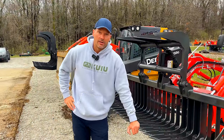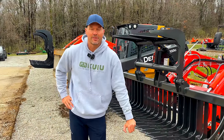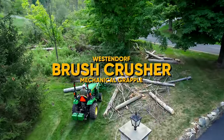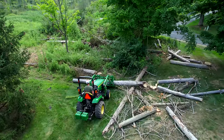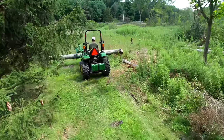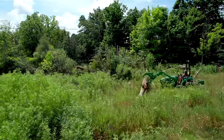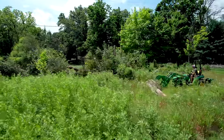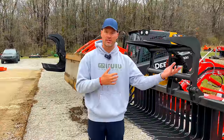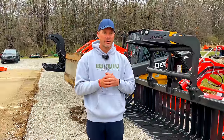If you don't want to mess with electric and you have a quick attach — John Deere quick attach, SSQA — you can get a brush crusher. I used to be really big on brush crushers, but prices have gone up quite a bit due to inflation. They used to be super cost-effective, but now it may be worth considering getting an economy root grapple plus a Summit hydraulic kit and installing that yourself. You may wind up at about the same price, but with a more controllable and versatile setup, plus your tractor gains a third function.